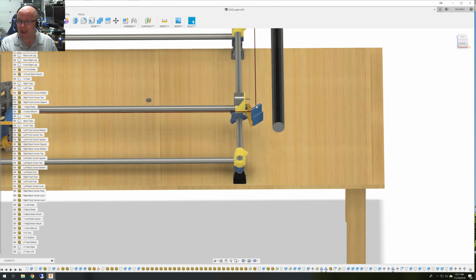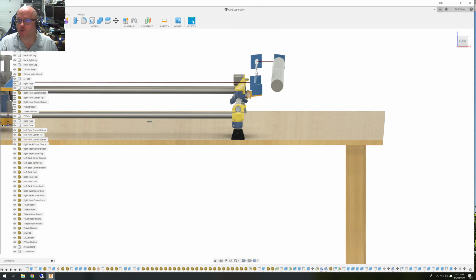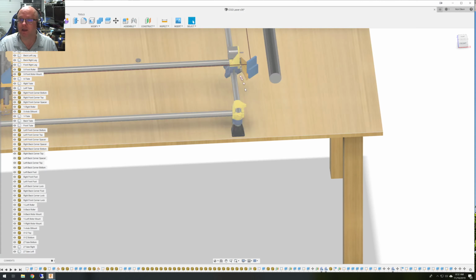It followed that line. And after I got that figured out, I knew what path the beam had to take, and I knew exactly how tall my pedestal had to be to put this mirror right in line with this mirror, and from a center scratch, left or right where it had to be. And from there, getting this aligned with this mirror was a lot easier, a whole lot easier, because I'd taken all the physical fine tuning out of the picture, and it just came down to the little thumb screws on the back to make sure you get this laser perfectly parallel to this tube of travel.